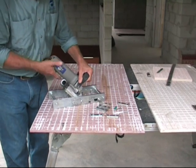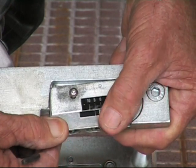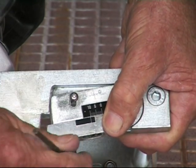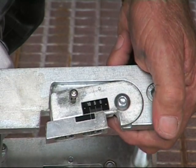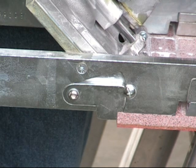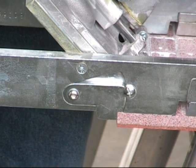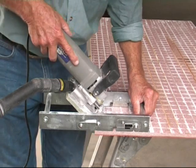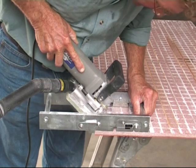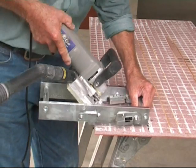The cutter is a fully adjustable machine cutting from 0 to 10mm joints. The bottom cut in the panel is set by the cutter machine and the top cut is adjustable as shown. This demonstrates the cutter installing the bottom cut in the panel and how the clip sits into this cut at the centre line.